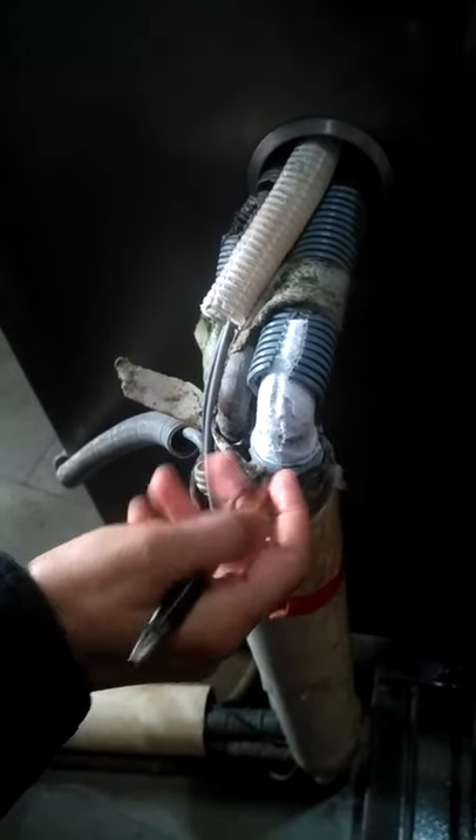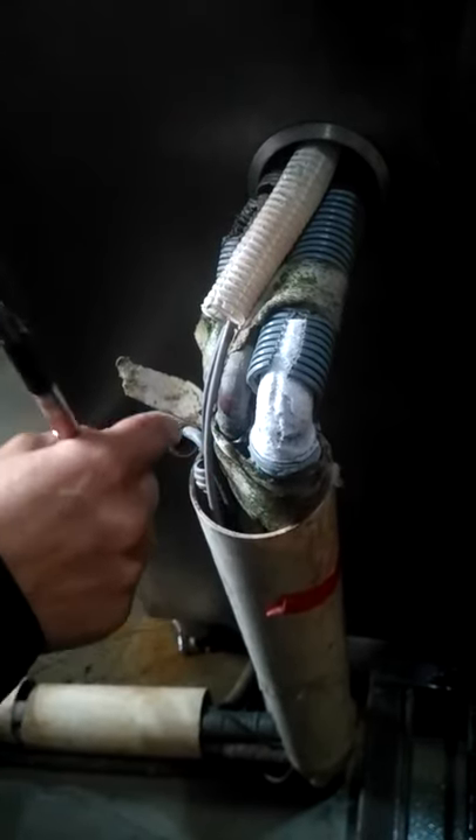Lower temperature, lower pressure vapor refrigerant will be coming via this larger diameter pipeline, going back to the compressor system. Inside, we can see these two pipelines — one smaller diameter pipeline going directly to the inside, and this larger diameter pipeline which is exiting at this end.